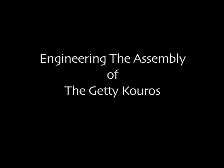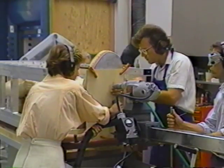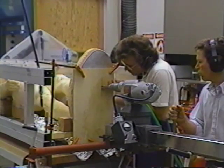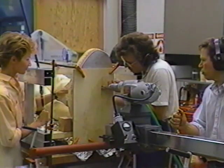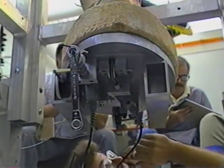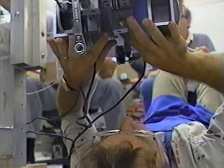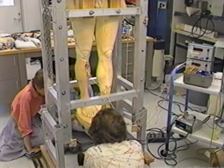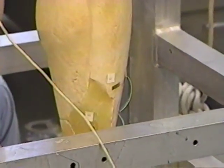The assembly of Getty Kouros, as I had specified, commenced by the Getty Conservation Department. In horizontal position, small diameter holes were drilled from the base of the plinth to the middle of the thighs. Stainless steel aircraft cables anchored in the thigh were extended to a thick aluminum plate attached to the bottom of the plinth. Attached to the aluminum plate were post-tensioning winches and load cells to apply and maintain my designed incremental loads. Straight strain gauges and geophones were attached in the vicinity of the fracture joints to monitor the marble's response to the applied compression loads.